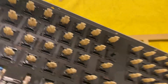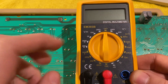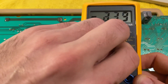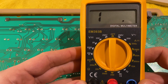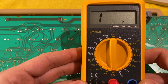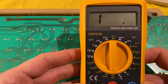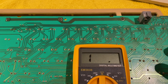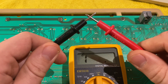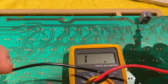I'm going to test that with a multimeter — it's a very basic one. You need to set it to the right position. I'm measuring resistance; I figured if there's some resistance, the key should be working. I've set it to the lowest possible value. When we connect it, it appears to be working — we have a resistance of around 0.5.